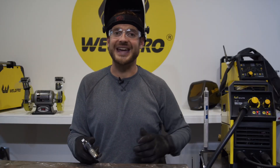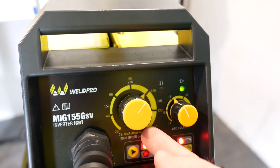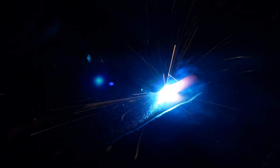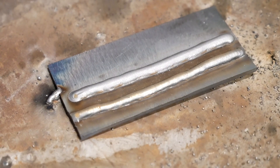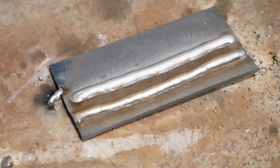With our first pass down on the plate, let me go ahead and adjust the settings on my machine a little bit and we'll put down a second weld. For this second pass, I'm going to adjust my voltage to 18.2 and my wire speed to about 300. Right away I can tell this weld is running a little warmer — it's laying onto the plate a lot nicer and it will be less humped up. Something I like to do when I get to the end of my weld is back my MIG gun up about a quarter of an inch and continue to weld to fill in the crater before extinguishing the arc. This pass came out really smooth. Take a look at the difference between the two welds: the bottom weld was my 16.2 volt weld, the top one was 18 volts.